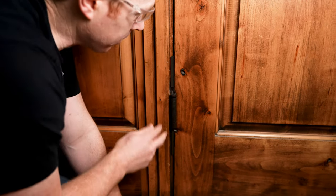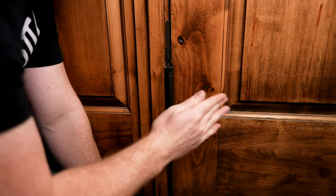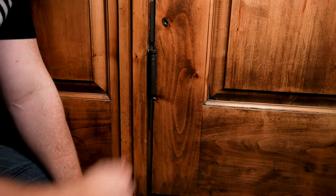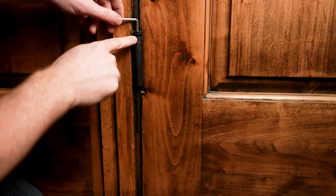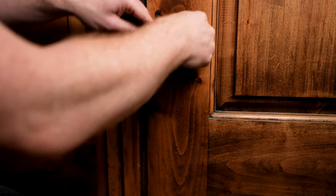I mentioned from the get-go that I put in spring-loaded hinges. The reason I did that is because I want to automate all the stuff — the lock, and we're going to have another little treat for you. I need to make sure that the door closes, and the problem with the front door is if you have kids, sometimes that door gets left open. The spring-loaded hinge makes sure that the door shuts so that your automatic locks can kick in. You put the allen key in the top, twist it, that puts tension on it — and you can see these holes down inside here on this little unit.